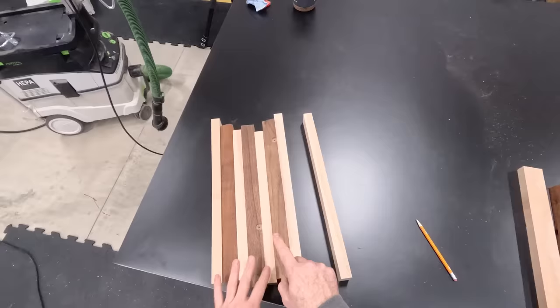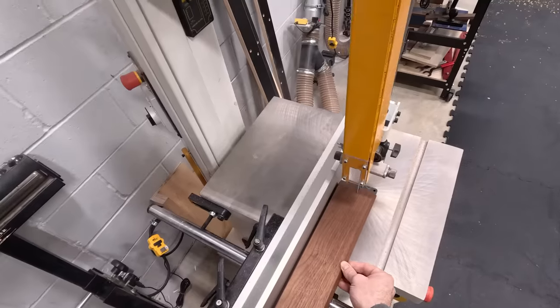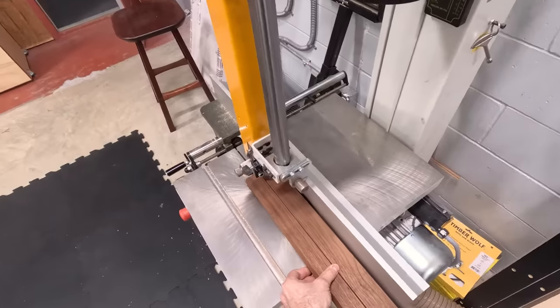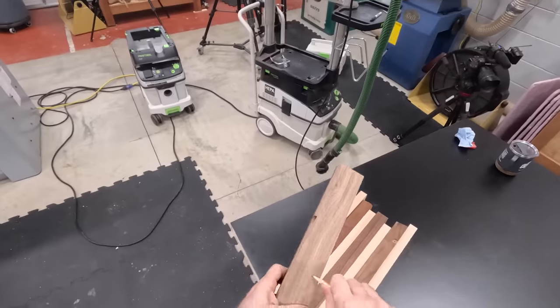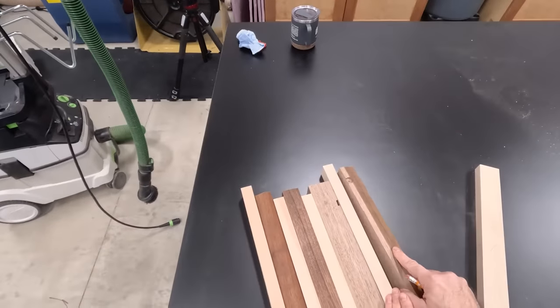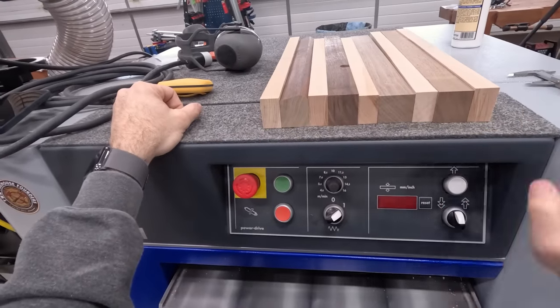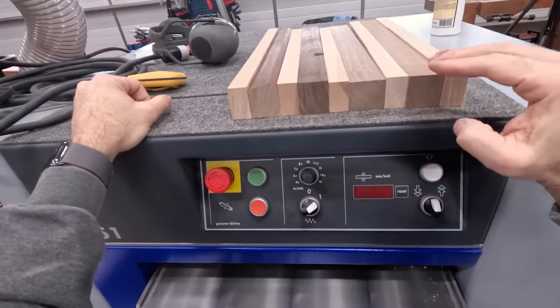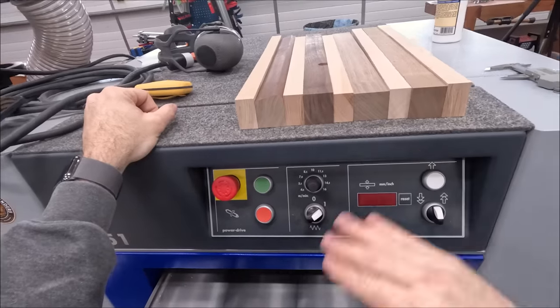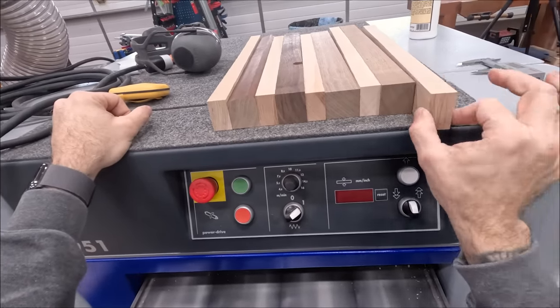I'm thinking that's feeling a little bit wimpy — I need a little bit more width here. I do have the hickory, and if you remember I did have this other piece, so I'm going to go bandsaw this down and get a fourth piece of walnut to mix in there. That's going to be a more standard size cutting board. Got all my grain oriented vertically, and now we can plane all of the boards down to the same thickness. I'm going to treat the walnut and the hickory separately to maintain different thicknesses of the individual pieces.